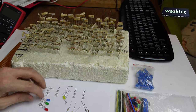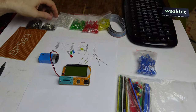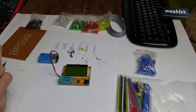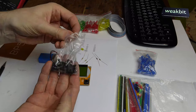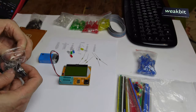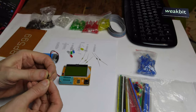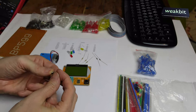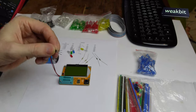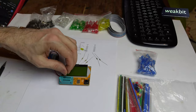Here are the LEDs. Now we should have found out the transistors. They should switch the LEDs. I have here two packs. Yes, it's quite difficult for me to read this because it's too small. So I need this transistor tester. I bend the pins a little bit. You can see that. Bent pins on one transistor, insert it here in this tester.